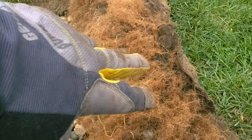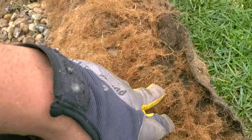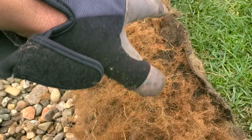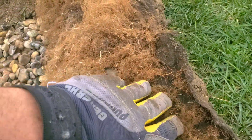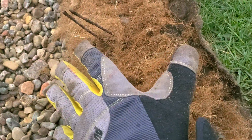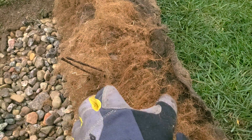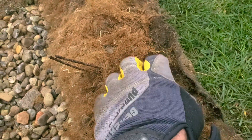Gravity carries the water down through tens of thousands — hundreds of thousands — of roots. In the fall when it goes dormant and slows down, the roots recede and the holes become enlarged for fall and spring showers. Right now it's dormant, the roots are very fine, and we have spring rain with the holes wide open. This is performing very well. Our drainage systems by design work better once all the grass roots have grown through the double-punched fabric.